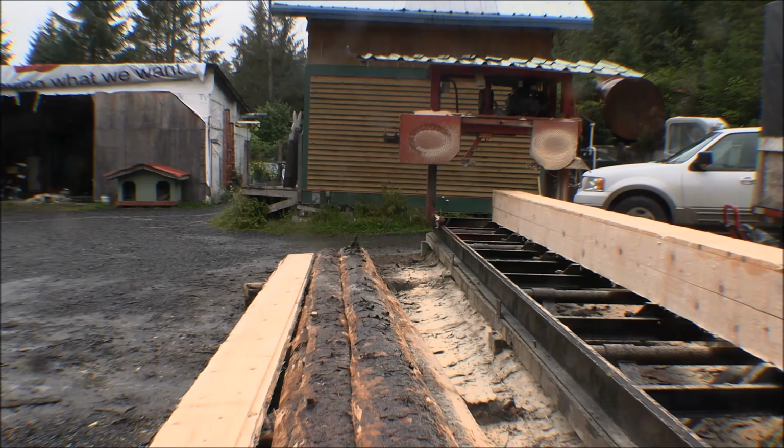Once I run a tape around them, they actually measured out perfect. They were 13 feet and 8 tenths, and they're supposed to be 13 feet 10 inches, or 166 inches. So anyway, I was trying to figure out why I couldn't get them to fit on the mill, and then I realized, well, I've got some adjustment on that idler wheel on that mill. Well, I come out and took some time and set it up.